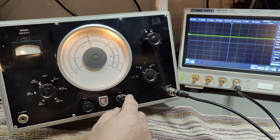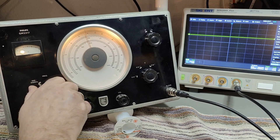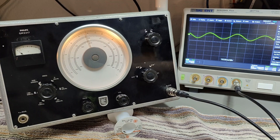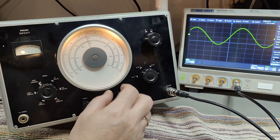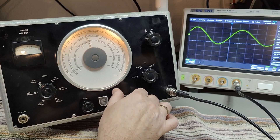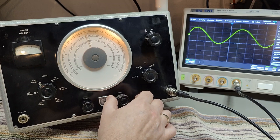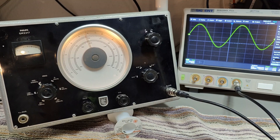There is something that is not working here — it goes on and on. Can you see the ripple? That is the problem. We are having power supply issues. I can also see the power supply is going up and down. Did you see that? And then it turns off. There is definitely a problem with a capacitor somewhere.